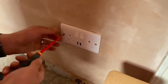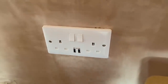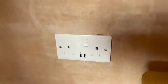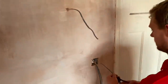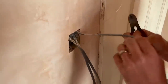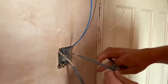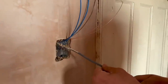Looking at the design of this USB socket with the slightly curved edges and the thickness of it — Base range. It looks nice, sturdy, a good finish. What would you have suggested it was, make-wise? Generally what I normally install — more of a middle-range socket. These are bedside light switches doing the wall light. What wiring method are you using — feeding the switch or three-plate? I tend to always run my permanents down to the switches. If you ever have a problem with fault-finding it just makes everything a lot easier, with the majority of connections in one location.